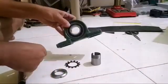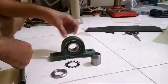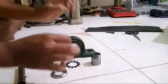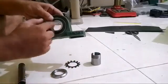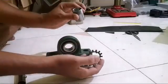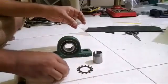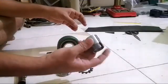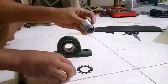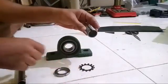This is a pillow block bearing, or plumber block bearing, used for locking axial movement of the shaft. You can get this bearing in the market. This is an extra attachment called a serrated washer lock nut, and this is a collar which is tapered — called a tapered collar with thread. You can get this whole arrangement in the market, or I can give you the link in the description.